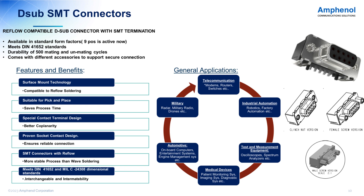Coming to SMT connectors: SMT, or surface mount technology, is the process wherein components are mounted onto the surface of a printed circuit board. SMT technology has existed in the market since the 1960s. Our focus was more on through-hole series in the past, but we have now come up with SMT terminations based on demand from OEM customers. These connectors are reflow compatible and come in tape and reel packaging, suitable for automated pick-and-place machines, which saves process time — the main advantage.